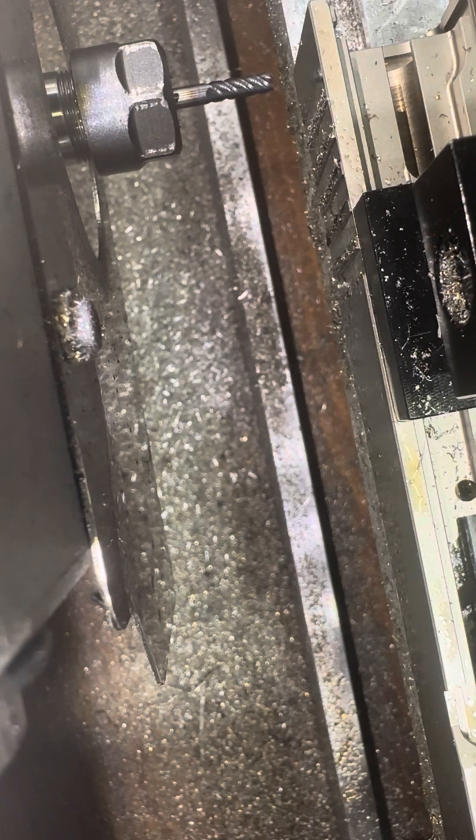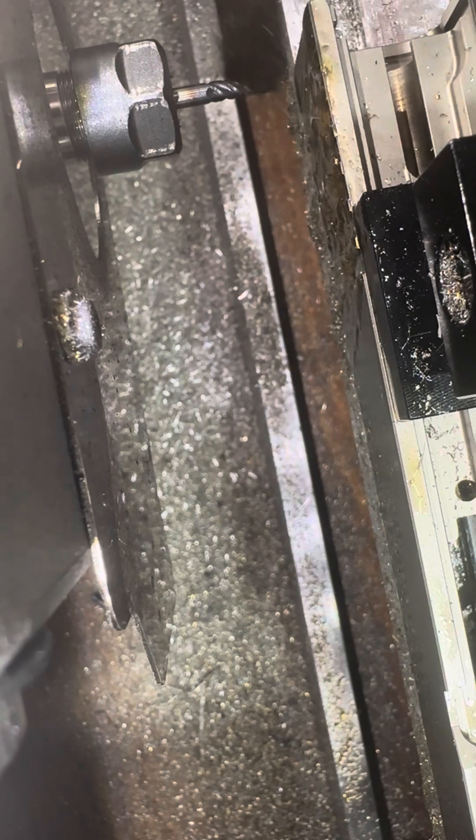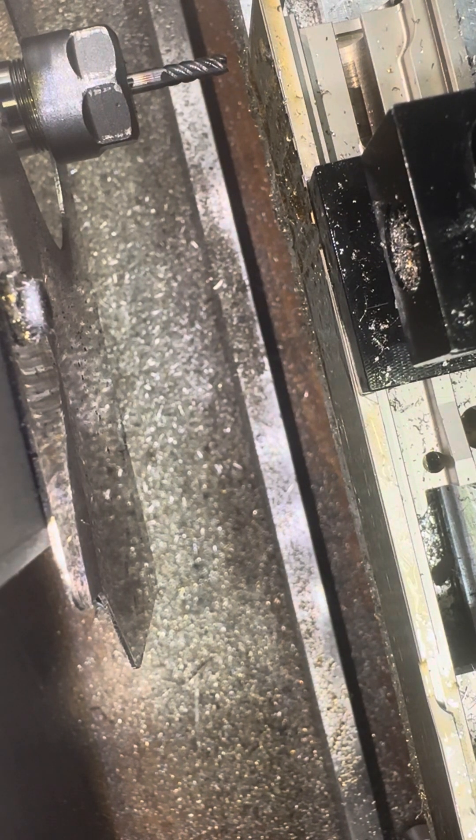The sanity check is where the end mill should go to the bottom right-hand corner of the slide — where the X and Y axis intersect. Put some cutting oil on there. You'll see cuts on this slide already — I started cutting it. There was an issue I had: my slide wasn't leveled out completely, so now I'm resetting the program and cutting it again.